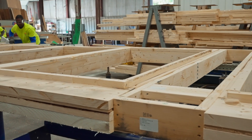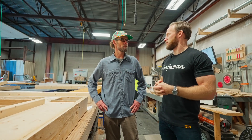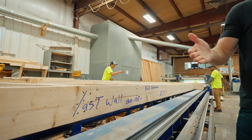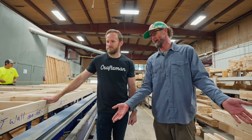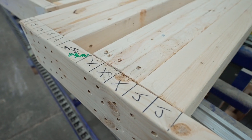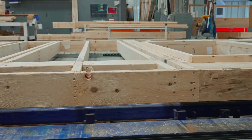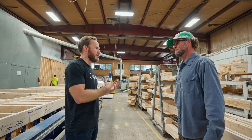Things like window boxes are not a standard detail, but Cape Cod Panel is able to adapt because they're creating efficiency in the process of building a wall. Something important is the nailing pattern on the bottom of the stud. In the field when framers are in a hurry nailing off the bottom plate, they don't always pay attention to nail pattern because the wall gets stood up and no one sees it. Here, they're producing a product — it has to look like it was manufactured in a controlled environment. When guys nail a stud pack together in the field, nails placed improperly can go in between the studs, which is just as bad as missing the stud entirely.